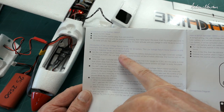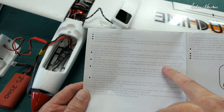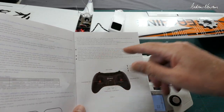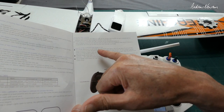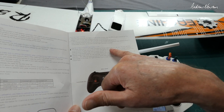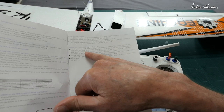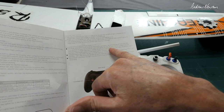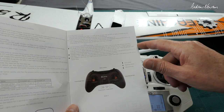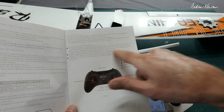In the low voltage return to home mode, when it detects low voltage — which is 3.3V for lithium ion, or 3.7V per cell if you've set it to LiPo — it will trigger return to home. In return to home mode, the plane will fly back at about 13 metres per second to the takeoff point and then circle around at 70 metre altitude, 50 metre radius above the takeoff point until you change to another mode. Also, when the altitude is less than 30 metres and the throttle is at the lowest position, the motor will stop.